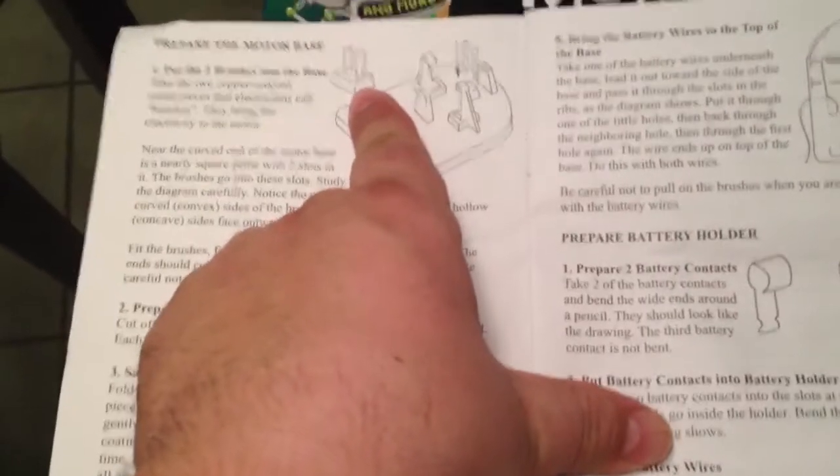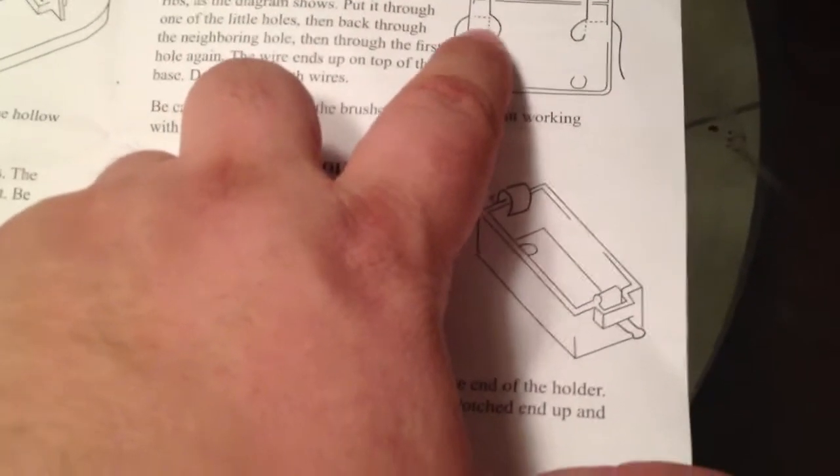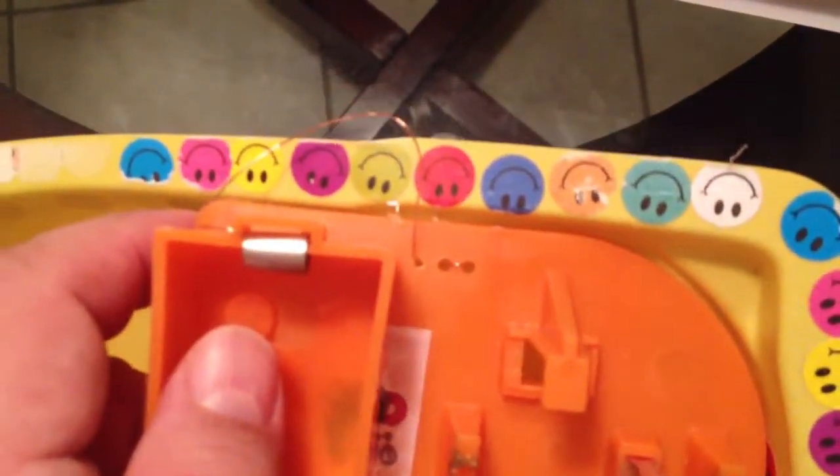The key is that there's a piece of the shaft that will be notched, so make sure you identify that — it'll be important which way that goes. The other key pieces are the little brushes, which go into the plastic boat right there. I made a couple of very minor modifications. The diagram shows how to connect to the brushes, then you connect the wire that comes with the kit. Instead of using the default holes, I drilled a third hole with my electric drill so the wires come up through the top.